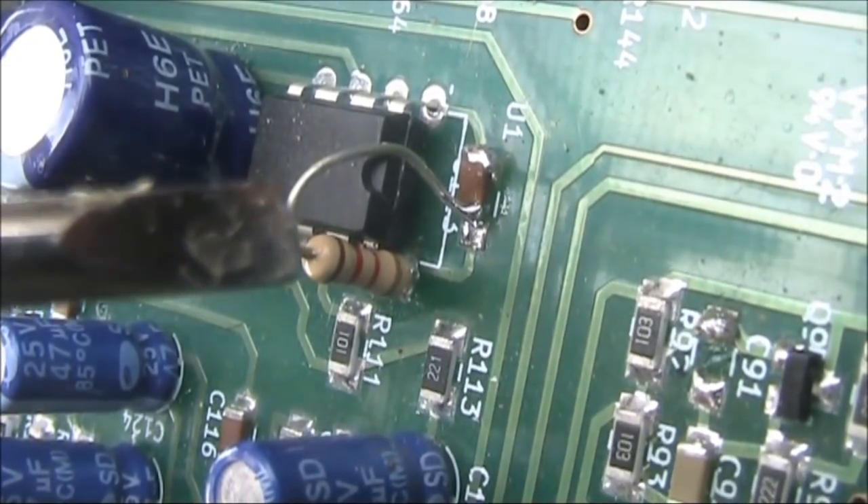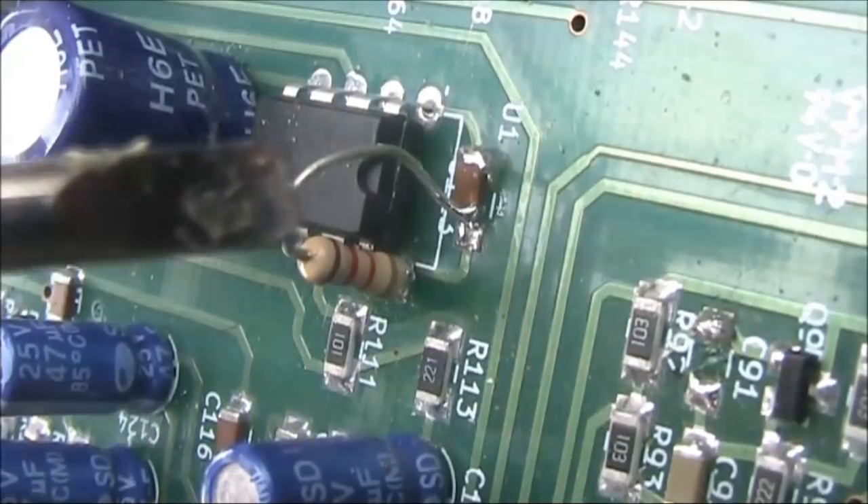In fact, when I get home, I'll be taking out this resistor and going back to the original circuitry, with the chip capacitor bridging pins 1 and 8.